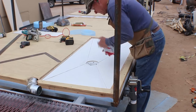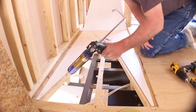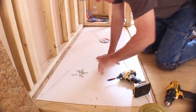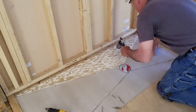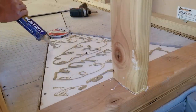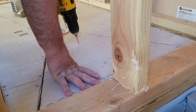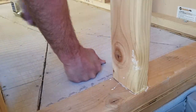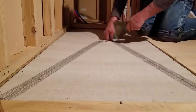The material I'm using is quarter-inch melamine — in this particular brand, the center core is a very hard masonite-type product. I think with good support from the pine structure below this should work out all right. On top of this I'm adding quarter-inch pieces of hardy backer. I'd prefer the half-inch hardy backer but that thickness is more than I can use in this setting. With the two-inch support frame, the quarter-inch melamine, and finally the quarter-inch hardy backer attached with liquid nails and screws, the floor is feeling pretty solid. I'm pre-drilling holes in all of these layers to minimize the risk of splitting, since each product by itself is pretty fragile.